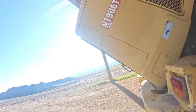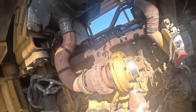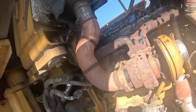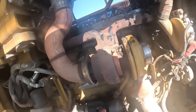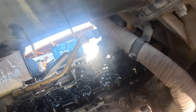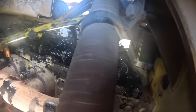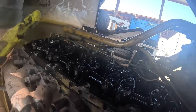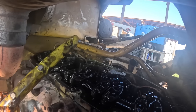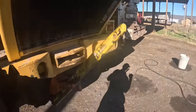So that's the update on that. I've got the rockers in, making sure I get the push rods seated right. I didn't adjust the valves on it — I took it off and left them alone. The owner said they had run the valves on it trying to get rid of the knock because they thought it was something else, but it was the injector. Let's double check our valve bridges, make sure they didn't move. I'm going to start it up with the valve cover off.